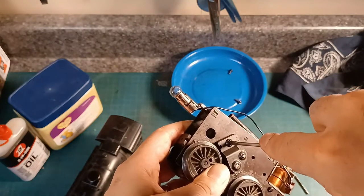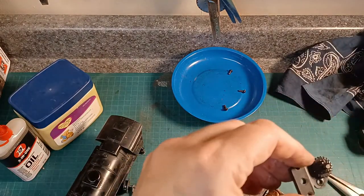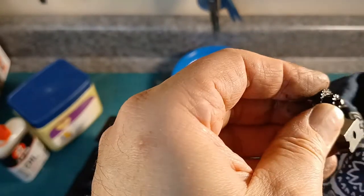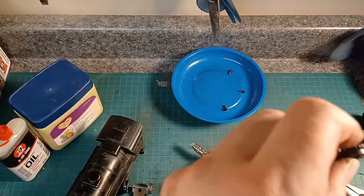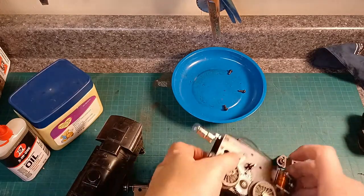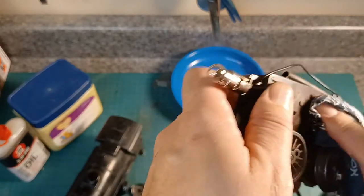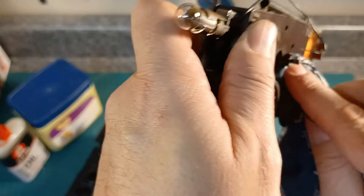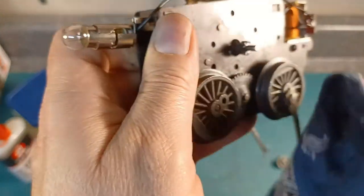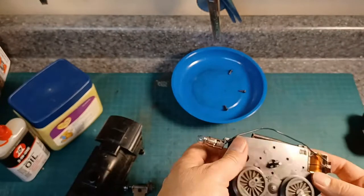Here's the bearing plate, just like all the other locomotives have. So we'll get our bigger small screwdriver — we'll crack this one off. That was way too tight. So we can just give it a bit of a wipe, a little bit of a wipe here, get some of the excess off that it doesn't need. You can drop a little bit of grease on there. That's getting quite a bit of a buildup on it — so I want to get some of this excess off. Like I said in the other videos, you don't need a whole lot of grease on there. You don't need it caked on, you don't need it so thick that all the dog hair, cat hair, carpet fibers start to make the chassis look all fuzzy, because that just starts gumming things up and jamming it up.